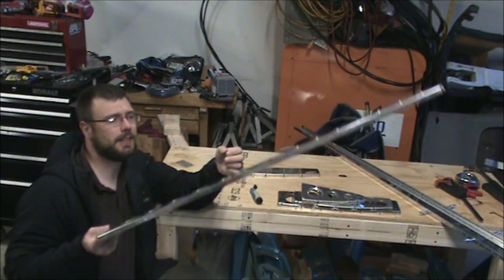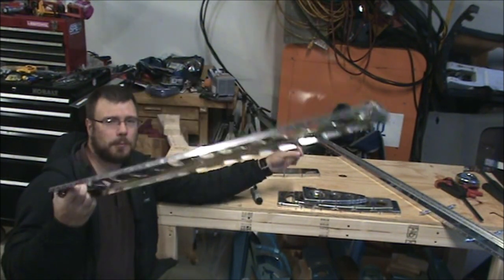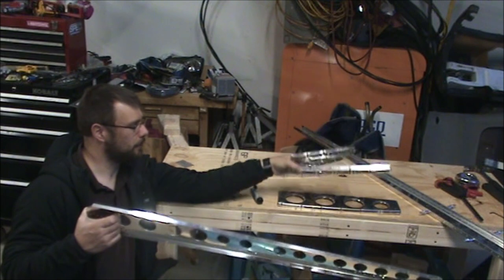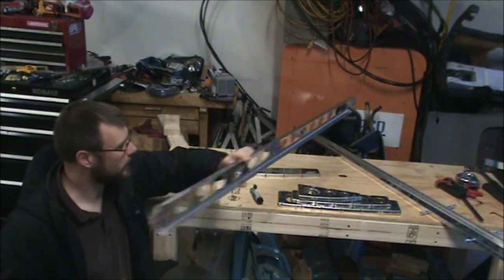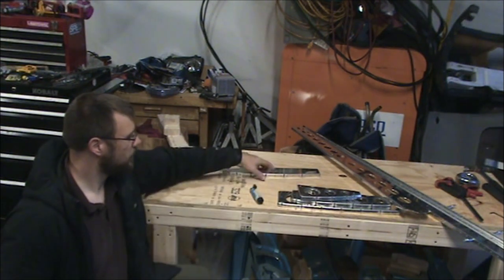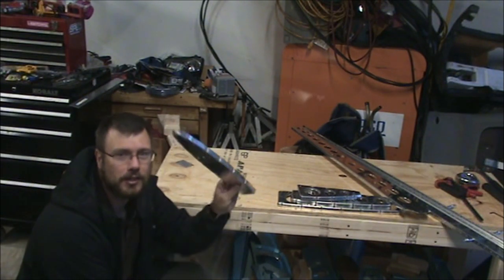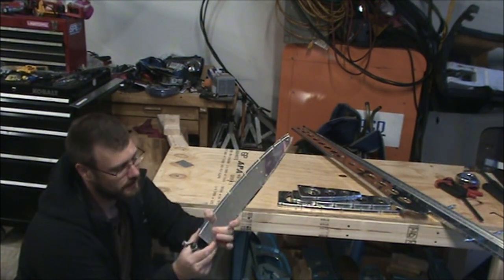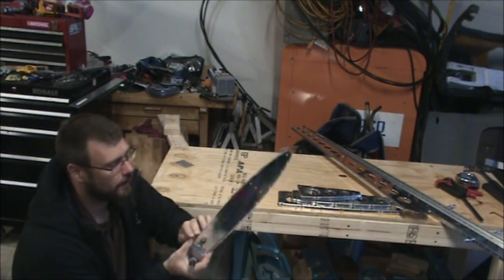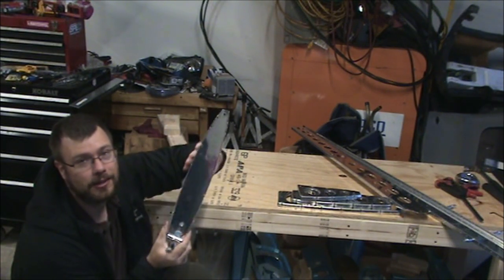So basically, it's real easy to look at a part and go, oh, this is a spar, based on the shape of it and where it attaches, we know these are ribs. And they're all going to kind of have basically that same look. So that'll help you out a little bit when you're reading plans, looking for parts, because this is not open and it doesn't have a solid flange, it's a good bet that it's a rib. If it had a solid flange along it, it's a good bet it's a spar, because on the spar, they're not going to break up that flange because that's where the strength comes from. It's basically an I-beam type design. It's just that it's only one half of the I-beam.